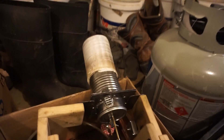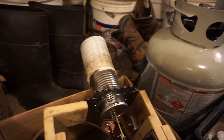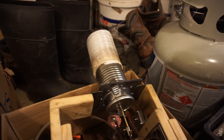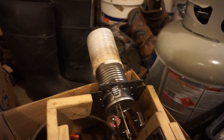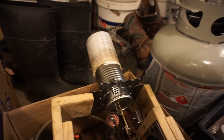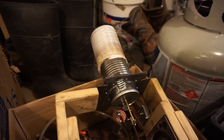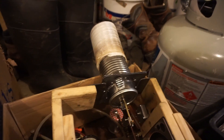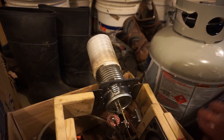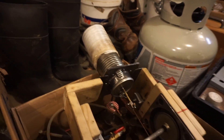So when I tried to fill it up with water, it leaked all in there. Luckily I had some files, so I scratched the area around the hole, made sure it was all clean, and then I used a soldering iron and my blowtorch. Luckily I brought solder and flux, and used those to patch the hole up. Because there was a lump where the solder was, I had to use my little files to file the solder off and get it smooth enough to run it again.